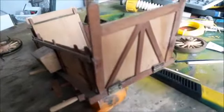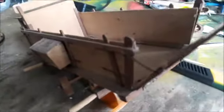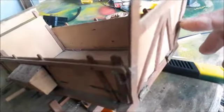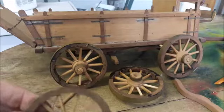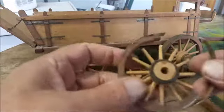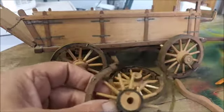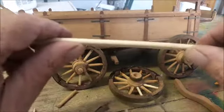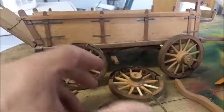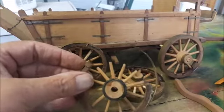Okay, and I repaired the back door as well - there's the hinges with small chains. Okay gentlemen, I'm so far now. Three is finished. So I need to make this part that is now missing on the one wheel - I've used all of them up in that wheel. So I'm going to use this wood, which is the right size, and I'm going to steam it and bend it in the correct radius to make this part. That's what I'm going to do now.